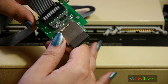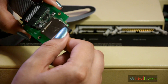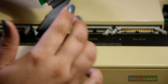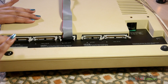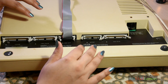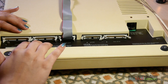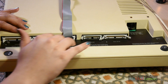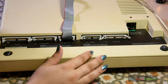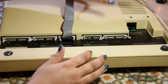James kindly included a BBC Micro MMC interface — basically an SD card adapter. You can fill up the SD card with BBC Micro games and programs and load them directly via the user port. Now at the back underneath, there's a Tube port — I have no idea what that is, if anyone does please comment below. There's a 1MHz bus port, the user port which the MMC connects to, a printer port, a disk drive port, and an auxiliary power port with plus 12V, plus 5V, and minus 5V — presumably for disk drives or external peripherals.